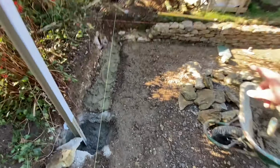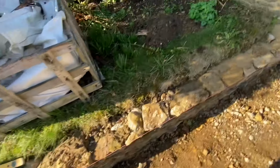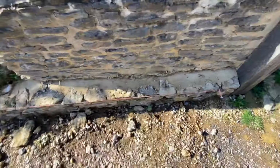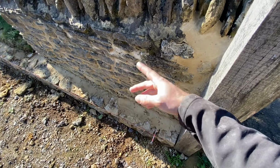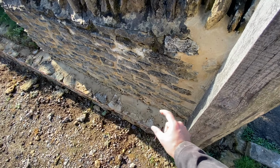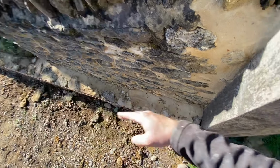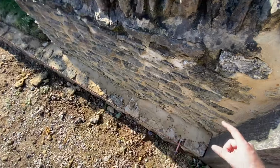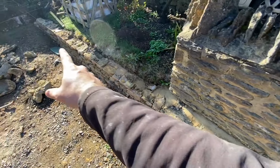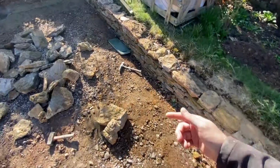So what I've done is, on this line, I've had to run it just in, if you know what I mean, because you've got an old wall here, but they're going to put an electric gate on this post. Because the old wall was sticking out slightly, I couldn't just measure off it. I've had to go in a little bit. It's going to slide this way, so I've had to make sure it's in line with this post, whereas that wall pushes it out. My angle from this post all the way to the corner there isn't flat, if you know what I mean, off that one.